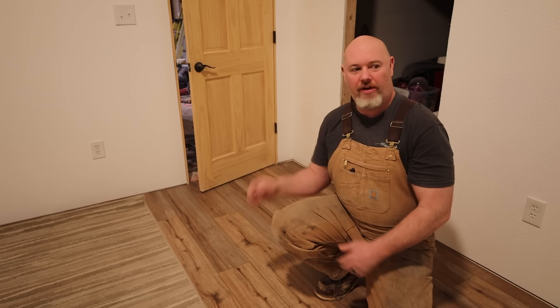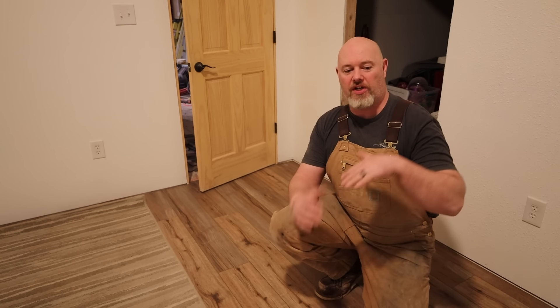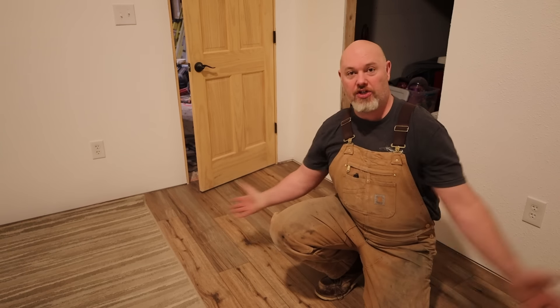So that was the floor laid down. If you want to know what floor we used, we'll put it in the description. I like the way this stuff locks together — a lot of click-lock floor doesn't lock tight and tends to slip, but this stuff seems really tight. One of the great benefits of this luxury plank vinyl with a 20-mil wear layer is it's phenomenal for pets. We put it in a house we built before and flooring professionals recommended it for pets — they cannot scratch it. It looks nice, it's easy to lay, it's a great DIY product.